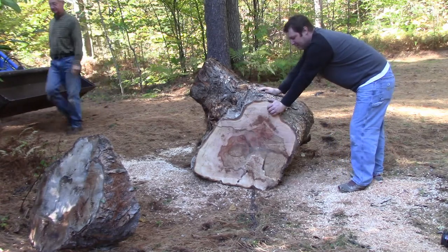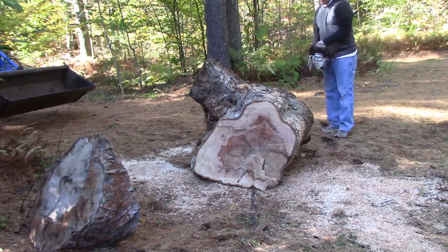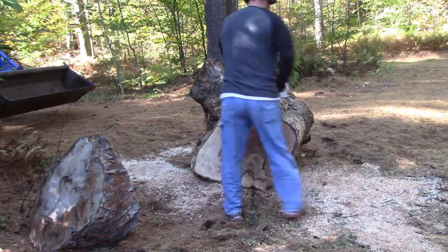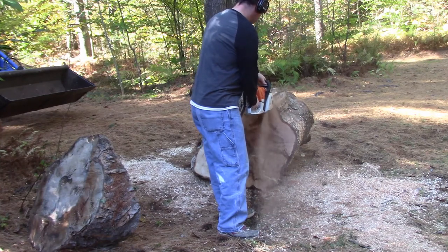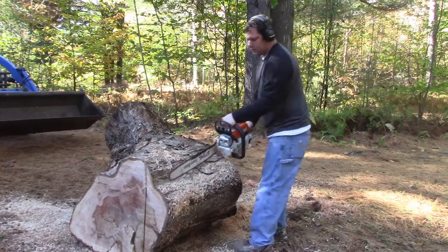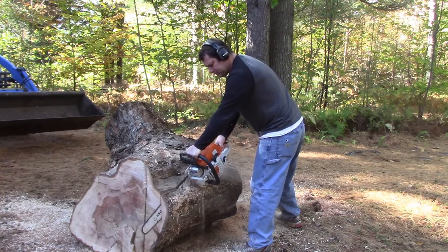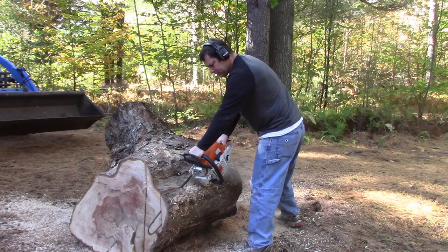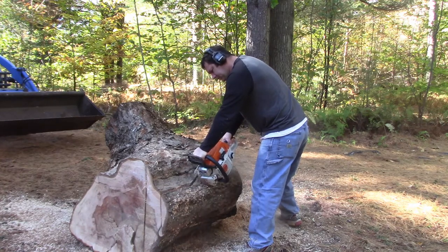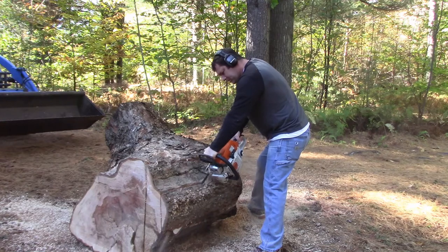Because it's so long and my chainsaw is 20 inches, I'm going to have to go from one side and then come back from the other to get the slab. Here in the beginning I'm just making a mark on one side so I have a reference point from the opposite side to try and get the straightest line possible. I've already used a tape measure and made marks on both sides of the log. I've got the slab just about cut off with just a little bit left on the bottom. I'm coming back and cutting off the end so I have a flat parallel face to attach a chuck or screw plate to mount it to the lathe. It's easiest to cut it off when it's like this because it'll just drop off.